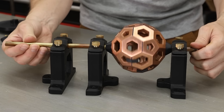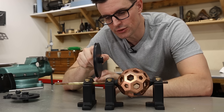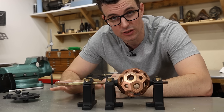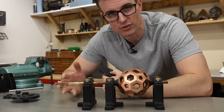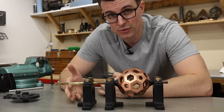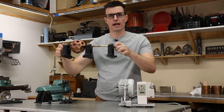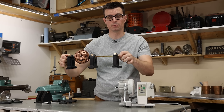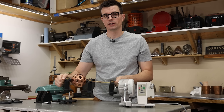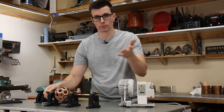I'm using three bearings because I'll be mounting a pulley right in between two of them. Right now the motor's going way too fast — it's about 200 RPMs at its slowest, and I need to bring that way down to somewhere around 20 to start with. So that's a 10 to 1 reduction, and in order to do that I had to print a few pulleys. Now all I have to do is build something really simple to keep this up and away from the motor so that anything magnetic in here doesn't interfere with any experiments we're going to be doing.